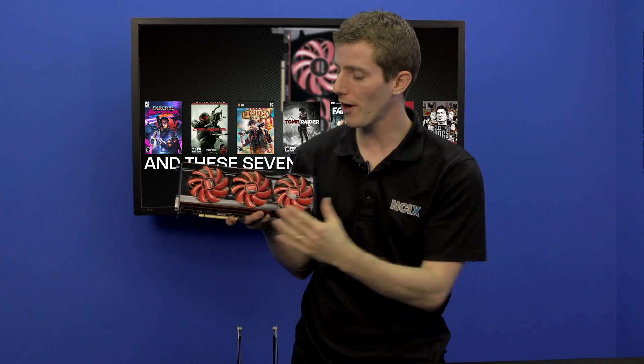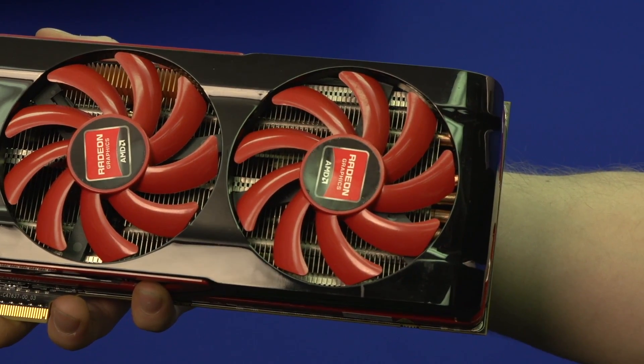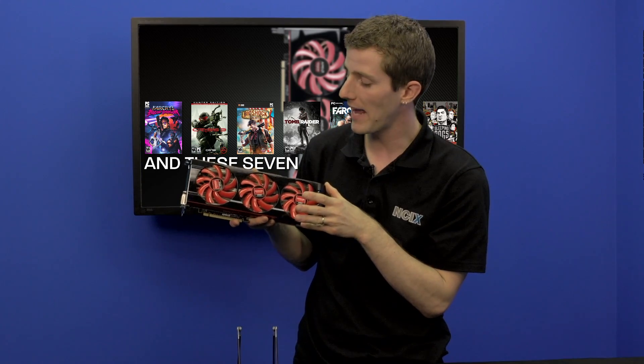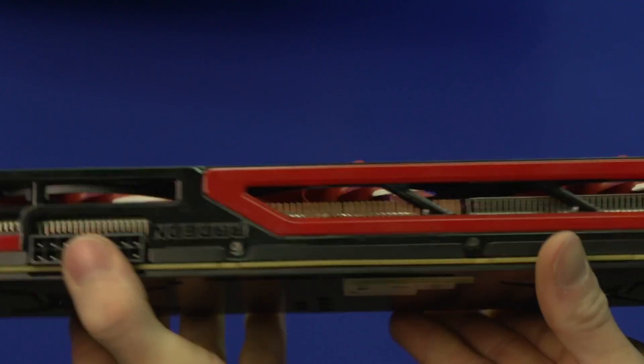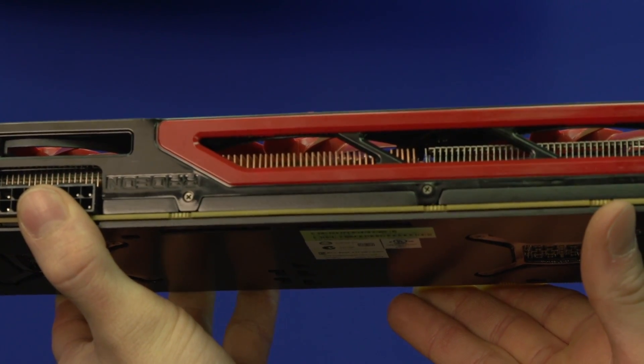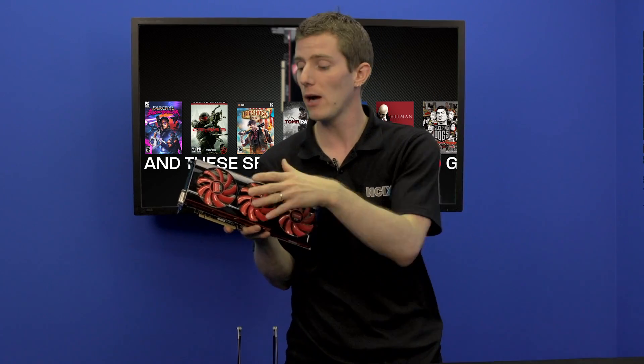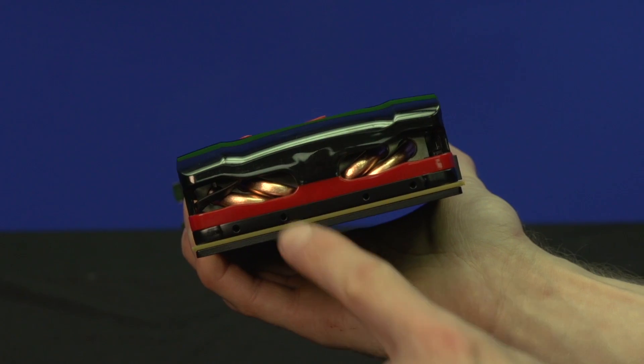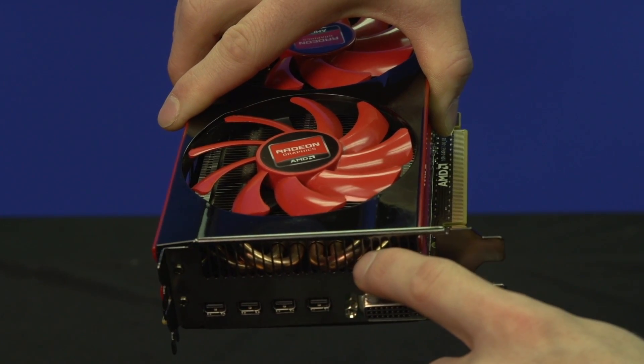Let's take a close look at it. The cooler is an extremely unique thing about this card. It uses three 92 millimeter fans and an enormous array of aluminum fins and even some copper fins for the PWM modules. This makes it basically equivalent to the kinds of coolers you would buy for an aftermarket card or some of the custom cards that individual manufacturers release outside of the reference designs. But this is a reference design. It has four heat pipes per core for each of those huge aluminum fin stacks.